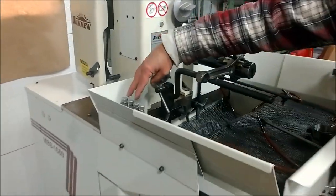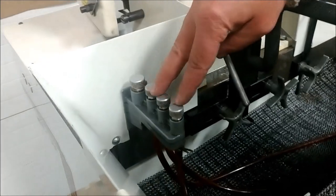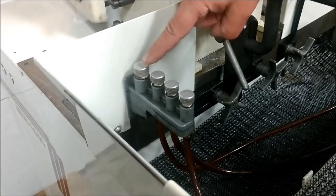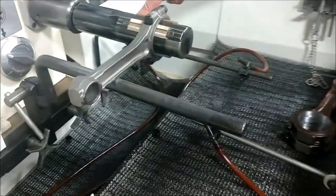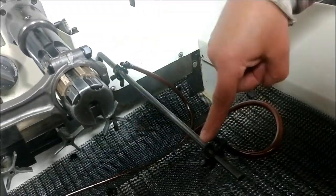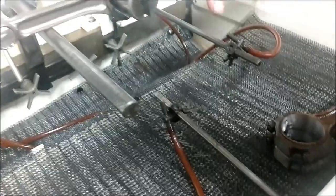Keep the oil in the system. Over on this side, it has adjustable feed control for your oil — the main control and then each individual hose. So here's your individual hoses, there and there, to keep lots of honing oil on your work piece.